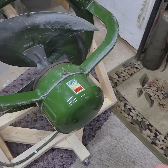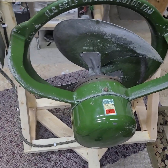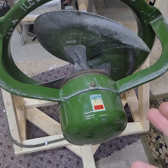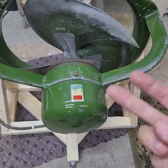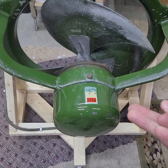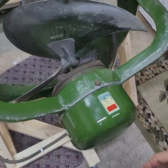For parallel on these fans, terminals 1 and 2 get wired together, and then 3 and 4 get wired together — that's your parallel connection. But for series, terminals 2 and 3 go to your line one and line two, and then 1 and 4 get tied together. That gives you your series connection and it'll run on low speed.